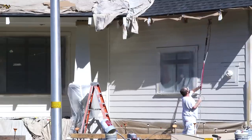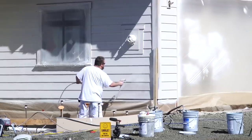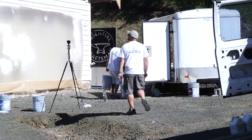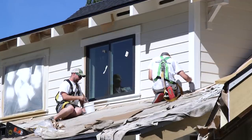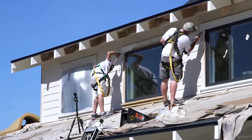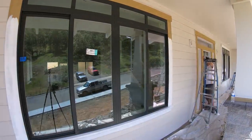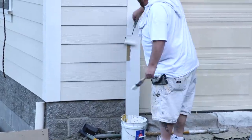We're painting the exterior, and as far as that goes, the interior, with latex paint. Latex paint is a wonderful thing. It colors and tints perfectly to absolutely any color you can imagine. It cleans up with water, and it sticks, or weds is the term with paint, to almost any primer. And the last thing is, it loves to stick to hardy panel. The pre-prime on hardy panels gets a grip on latex paint.